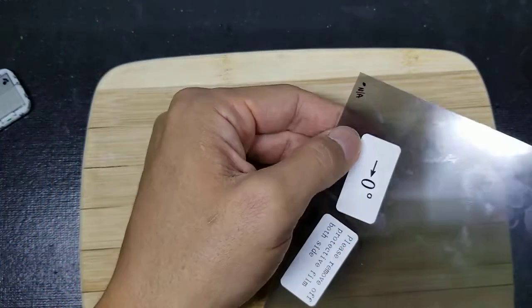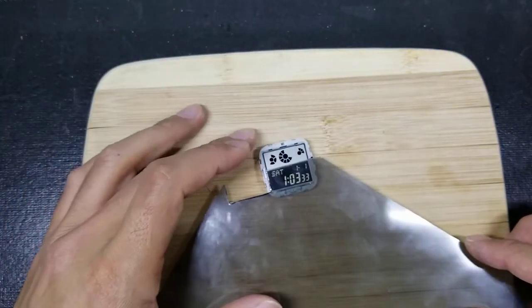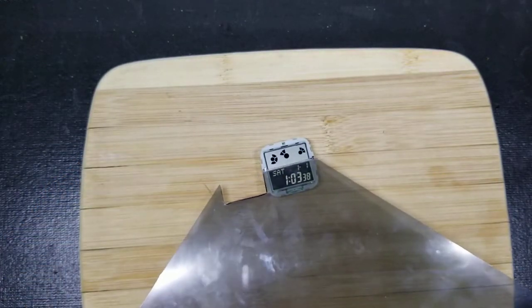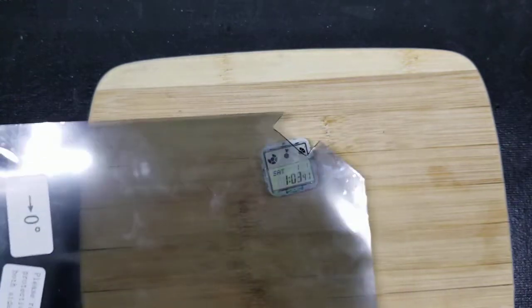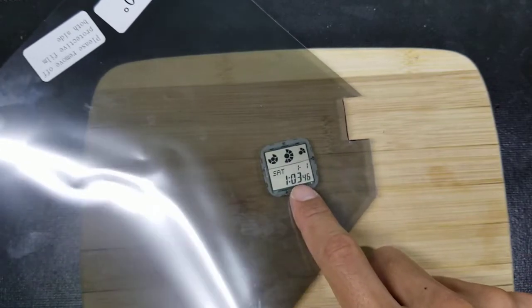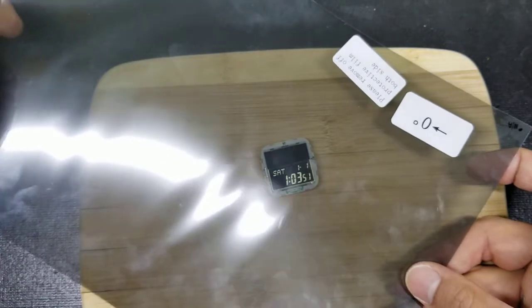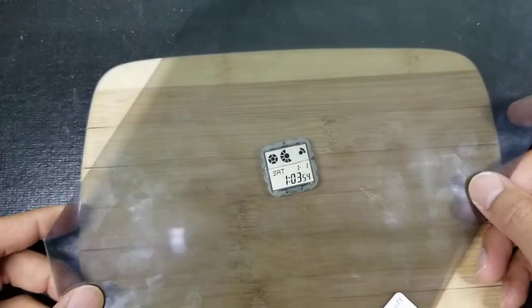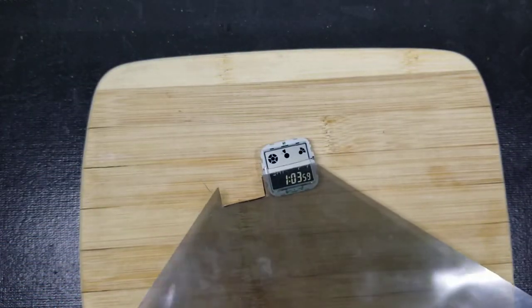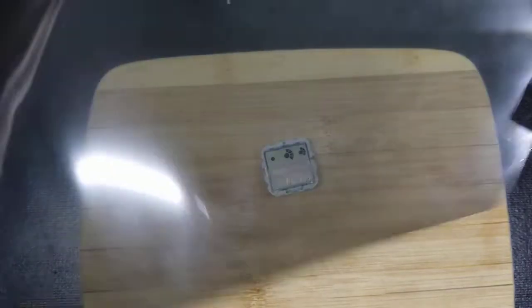Knowing this is my non-adhesive side, I'm going to line up my filter. Let me show you what happens when you rotate the filter around. That would be almost like the normal display from the factory. Then a negative display. Then normal again. Then negative again. In general, every time you rotate 90 degrees you change the color — 90, 90, and then again 90.